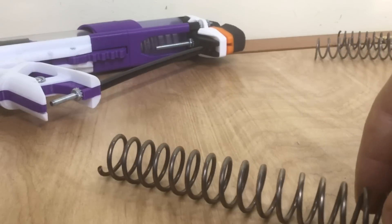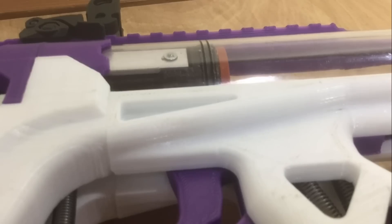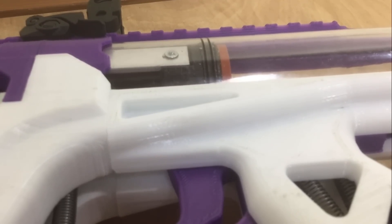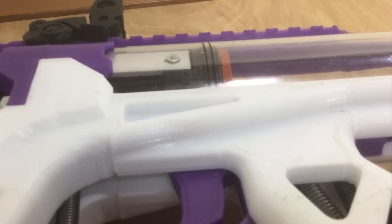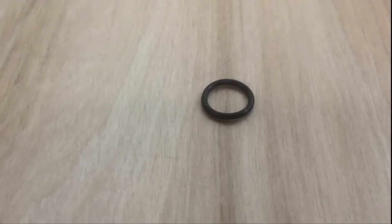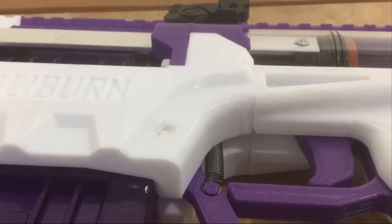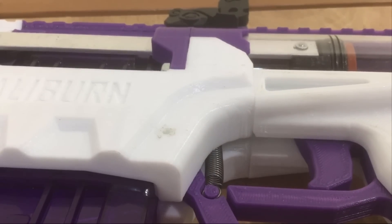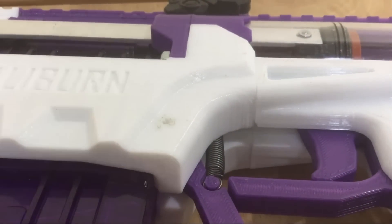You'll obviously need a spring — I also sell them on my Etsy store. I'm Remzak on Etsy. On the RAM piece, I actually use an X-Profile O-Ring, which frees up another O-ring for the plunger and improves the seal on the RAM. I'd recommend you place two of the stock O-rings on your RAM piece to improve the seal. Multiple users have demonstrated that this increases velocity. If you're truly trying to eke out every single bit of velocity, you should also replace your RAM with the aluminum RAM, which I suspect leaks less than the stock PLA part — most leakage likely occurs around the PLA part and then around the O-rings.